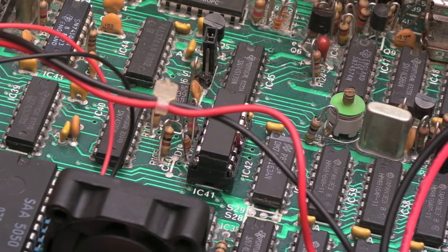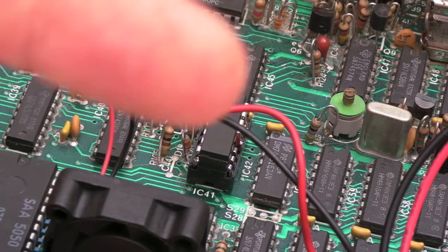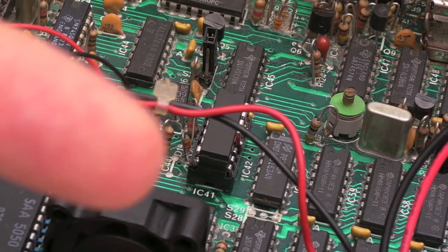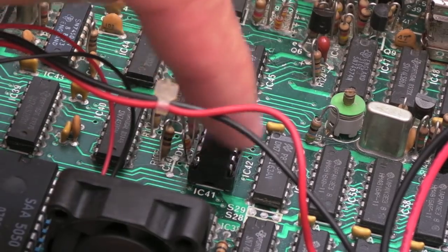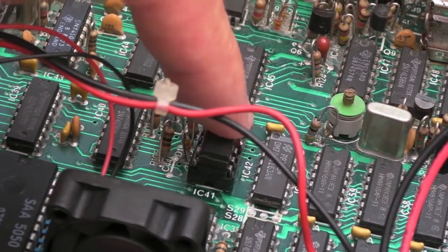and I went down, down, down, with different resistor sizes. The problem remained no matter what, and I got right down to just above 300 millivolts. I think I measured on the scope at 330. And the issue was still the same. It wasn't any better. It wasn't any worse. Exactly the same, and it was only at this point that we identified the problem with the chip.